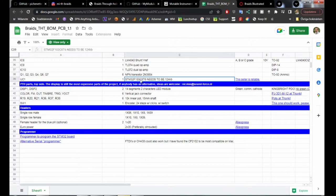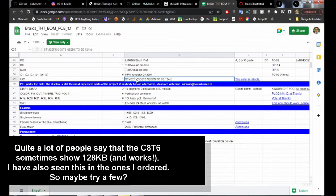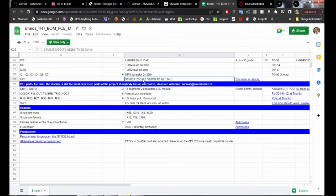I've tried a few different other modules. The newest module, the STM32F411, I believe it's called. I have not gotten that to work yet, unfortunately. Thing is, these are really difficult to come by. Not the C8T6, 64 kilobytes, no problem at all. The 128 kilobytes is really difficult to find. So if you have one of those in your arsenal of components, no problem. But if you don't, it might be difficult for you to find these. If someone has a link to someone selling these, please let me know so I can put the link in the description, because it's really hard to find these.